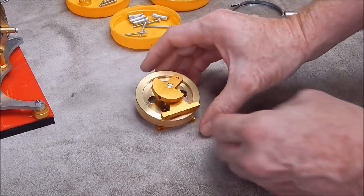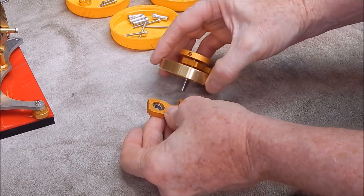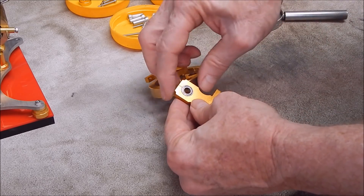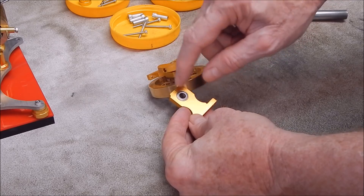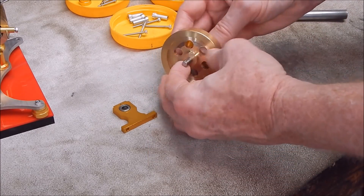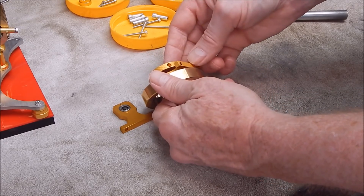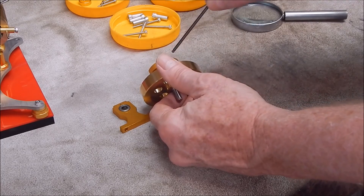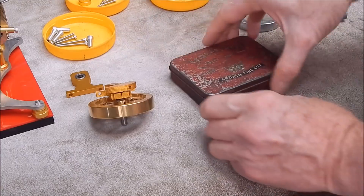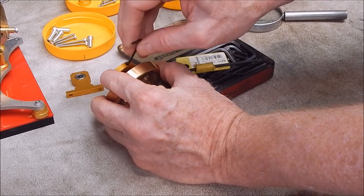Okay, now we've got to the guts of the matter. That comes off nicely. I like the way they did these bearings — just slit the housing and press the bearings in. That's a good idea; it just sort of grips them. Obviously they machined the hole just slightly undersized, slit it, and then it's a spring-loaded grip. Really clever. Now on this side there's a little Allen key grub screw — have I got one that small? I'll have to go to my tin of specialty bits. Maybe that's what those little Allen keys that came with it were for — and yes, they do fit that.